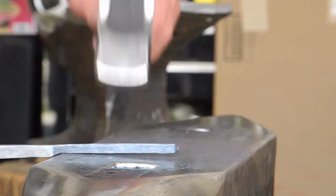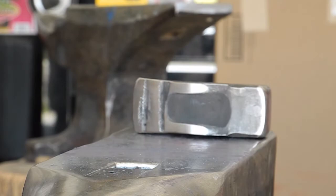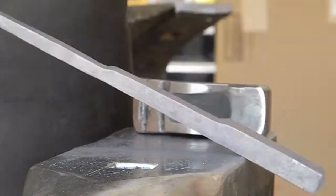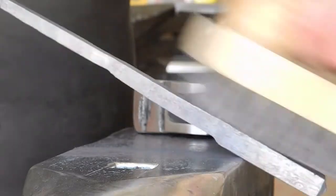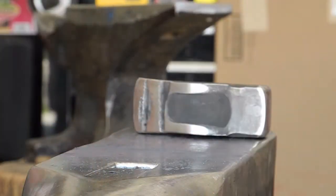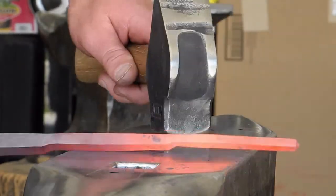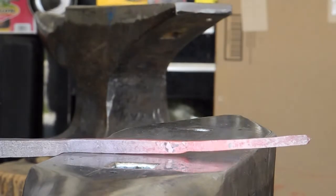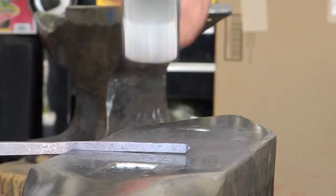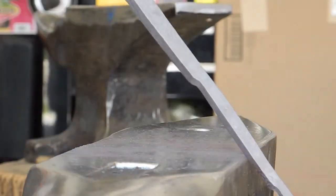And when you see something like a bottle opener and you want to make that bottle opener, that knife, that whatever, veined leaf scroll, you'll have a better place to start from. You can focus on the techniques required to produce those items, as opposed to trying to figure out how you hit this into a rhomboid shape, a diamond shape, and how to correct it.